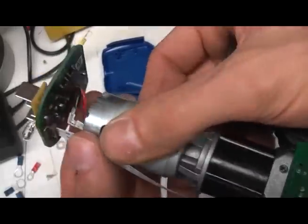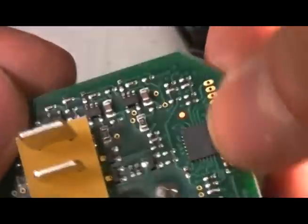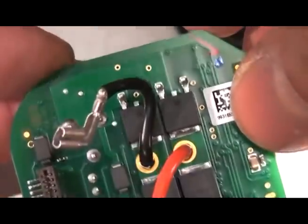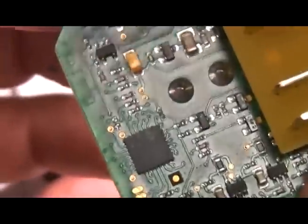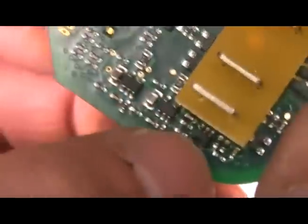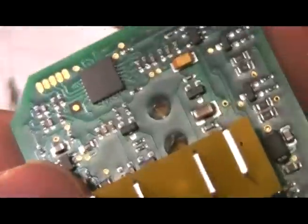So you've got the motor and then this control PCB at the bottom. On this control board it's all pretty much as expected. We've got a little PIC on there controlling everything. This side we've got 4 MOSFETs set up as an H-bridge, so you can drive the motor in each direction, forward and reverse. And there's a big 0.04 ohm current sensing resistor here, so it can measure the motor force, and just a bunch of passives, nothing really very unexpected. In-circuit programming pads there. I'm guessing maybe an op amp here to boost up the signal from this current sensing resistor.